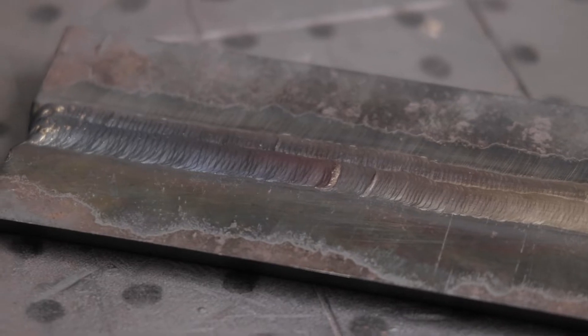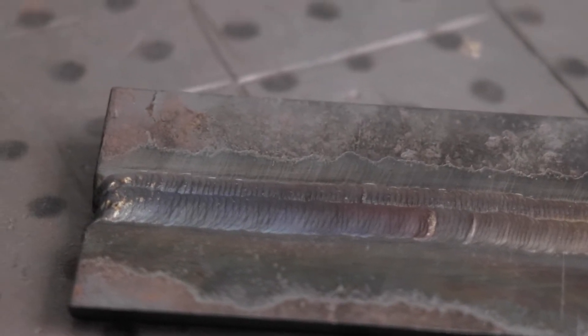Carbon steel gets really slick. Trying to keep it really consistent is the key. But the good thing about here is down in the shop we have quench tanks. So when you're running beads like this all day long, you just go dunk it in the water. Let it cool off — that way you keep right on trucking.